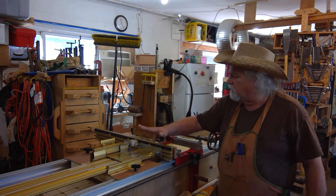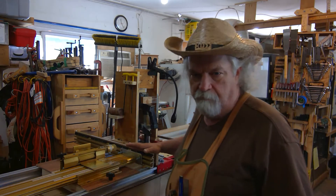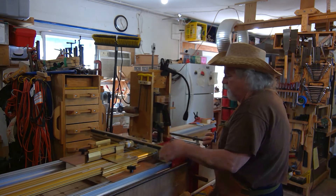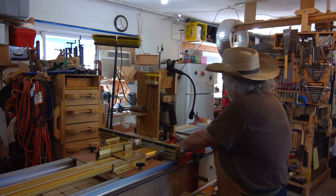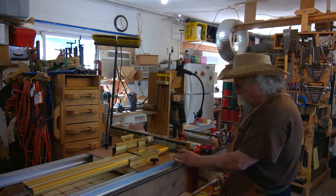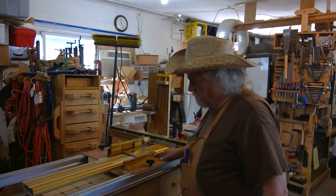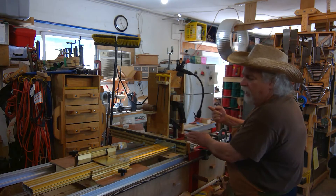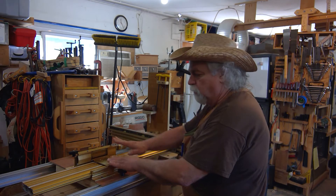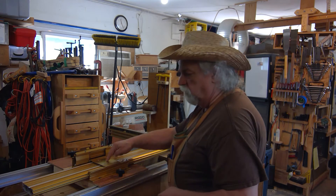Now the machine is attached to my carriage. I want to lock it down and establish zero on my x-axis — this only took a minute to set up and attach. I set my piece in here and decide where zero is, where my starting point will be. Let's say it's right here where the bit is — close to where I want to call zero. I take this loose, and from zero I know I'm going to do my milling going that way on my x-axis.